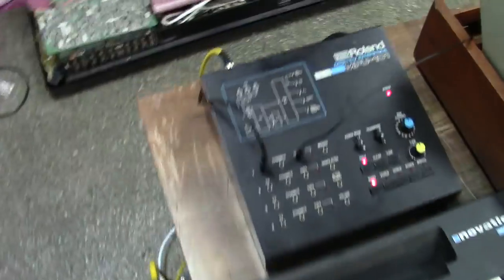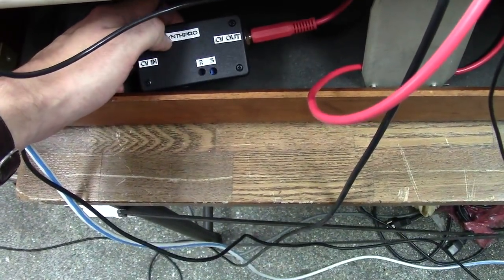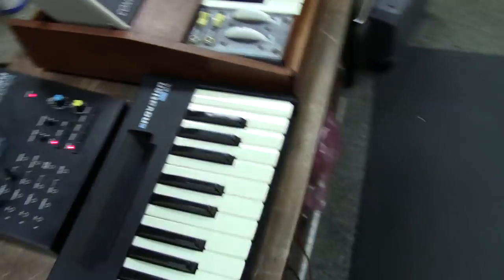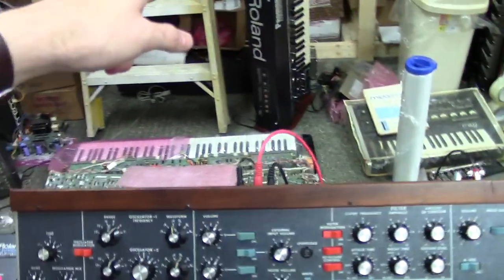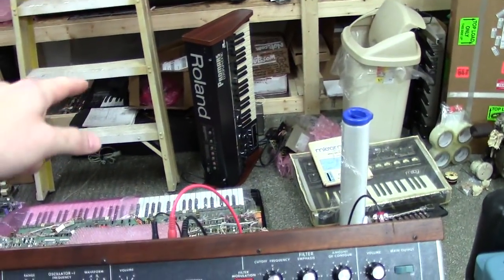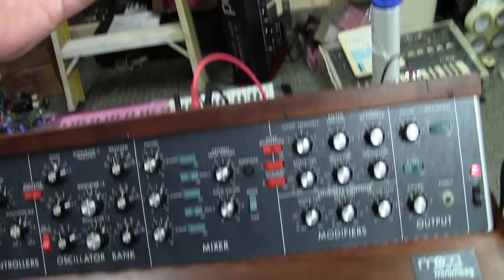And also, when I built this module, I built it to actually be calibratable. So you can range and scale internally, so you can adjust it for whatever synth you're using and tune it within the ranges of your external synthesizer. For instance, I've even hooked this thing up to a ProMars, which I have a video of on my Instagram, using the ProMars by Roland to control the Minimoog, which is a 1 volt per octave system.